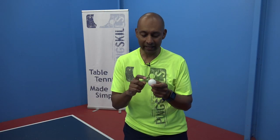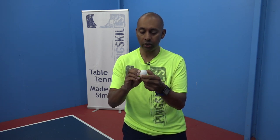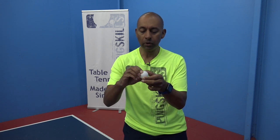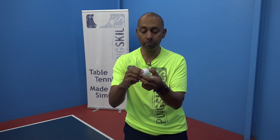It's important to test the hardness not just in one spot, but right around the ball. When testing a ball, you would move the ball around and press on several points to just make sure that there's an even amount of hardness on each point.